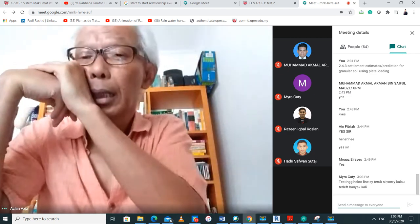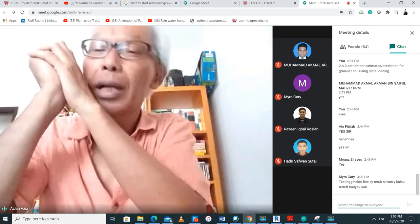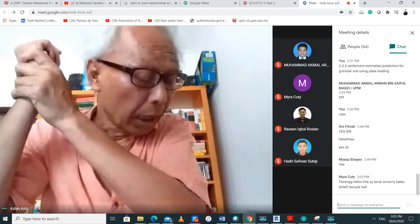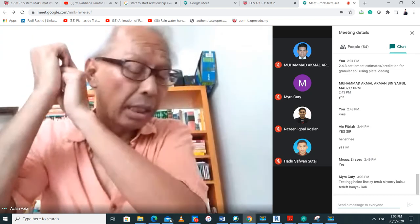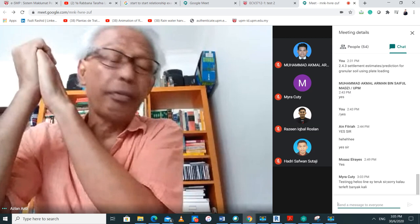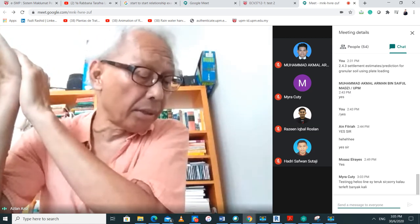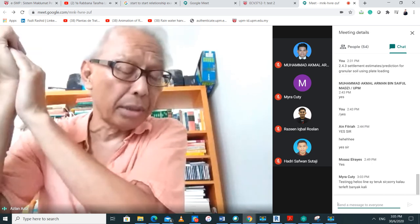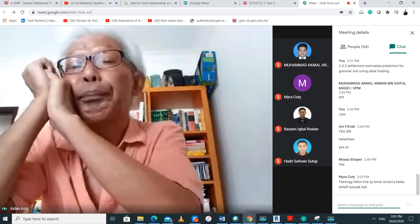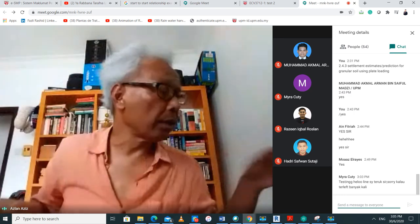Highly unlikely that I will be testing you on that. But just to give you an indication of the kind of things that you need to be aware of when you are designing for all your structures. So in table 14.7, you can see that for structural damage to the building, the angular distortion is a maximum of 1 over 150. All right, so basically, guys, I am done with settlement.